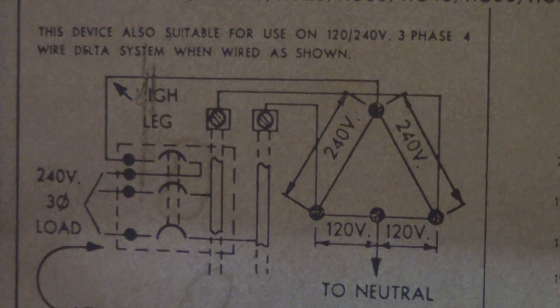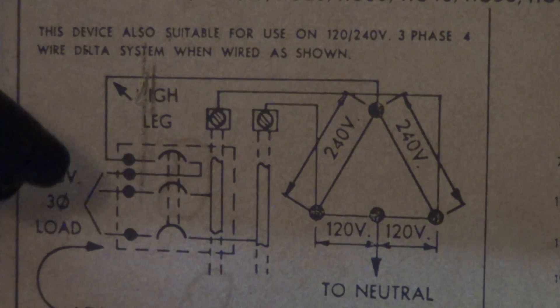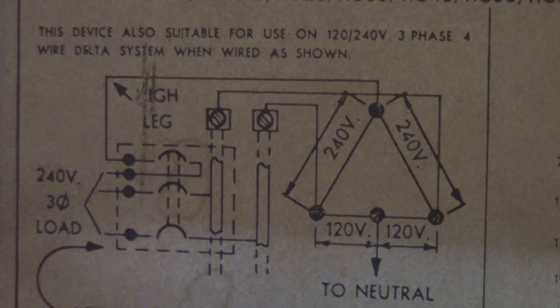That could feed off to a three-phase panel, but normally people would just put a three-phase panel in anyway. So most configurations, this breaker box — the delta breaker itself — was used for one load. It's used in older configurations, generally in houses built before 1978 and in small plants.